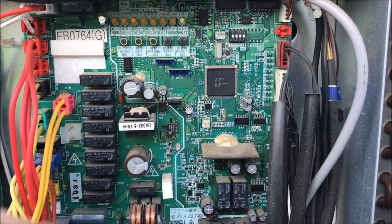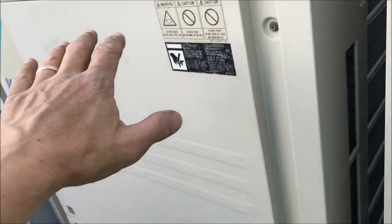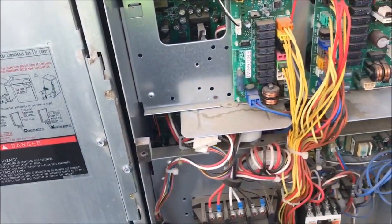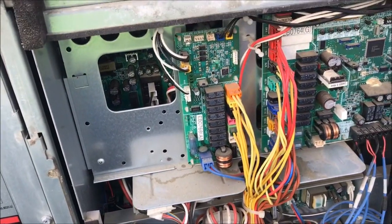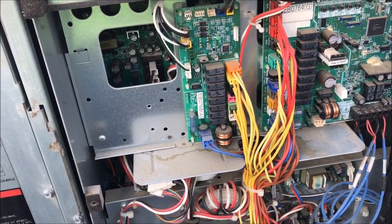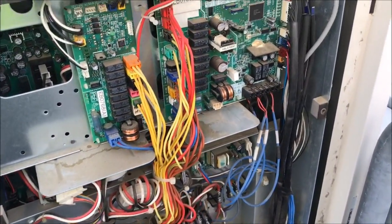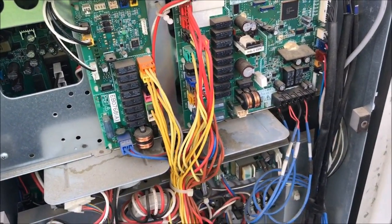No error. Light's still off. Now what it'll do, it'll shift all the load onto this condenser over here. We'll get 50% capacity, but the way the weather is right now, it'll handle it no problem. If we were in winter time, it would get by. The building is insulated well enough, but it has a tougher time. It seems like cooling load, it has an easier time.